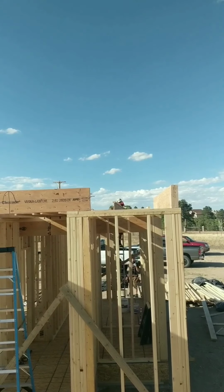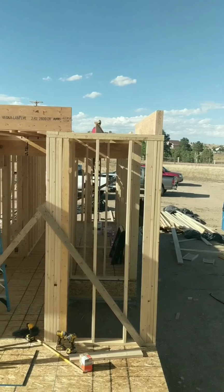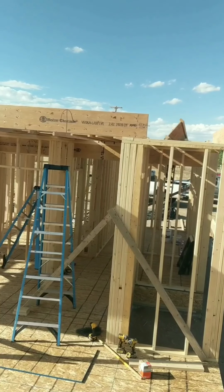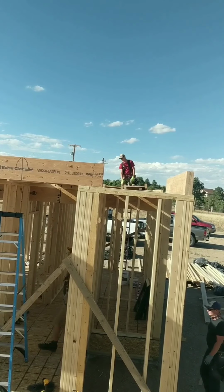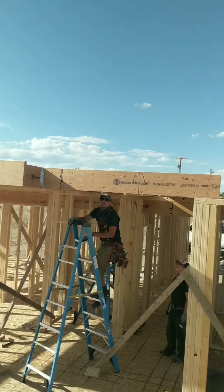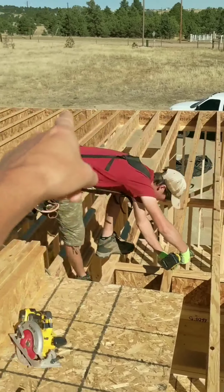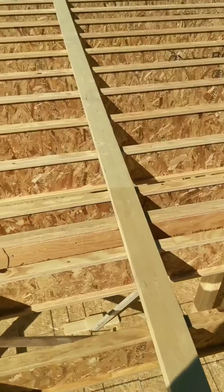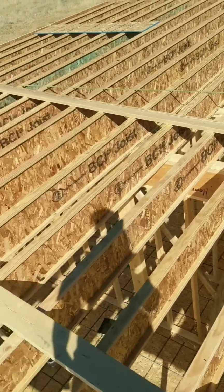They're really not that heavy because it's plywood in the middle, which is nice for HVAC and mechanical guys, because they can knock a lot of that out to run all their HVAC and electric, and plumbers can run their plumbing through. They just work out really nice, and you can get them cut to the whole length of the house. So we brought them all up, stacked them, and then would get up a few and install them, with a guy on each end, because I had a snap line on the wall end, snapped back to 1 1/8 inches, because that's the width of the rim joist, and I wanted to keep it straight, so 2 guys would go nail it.